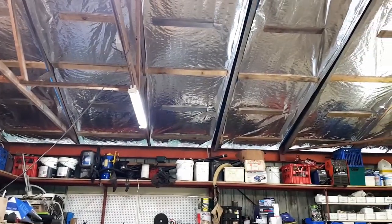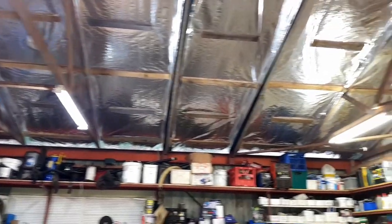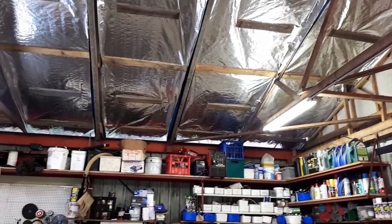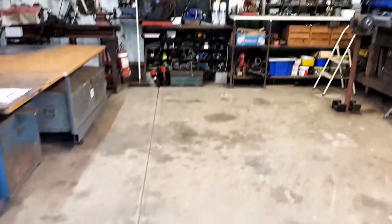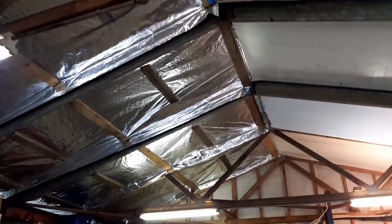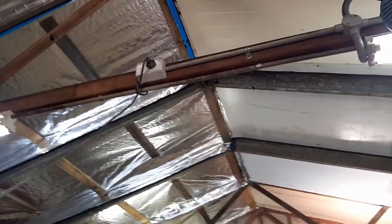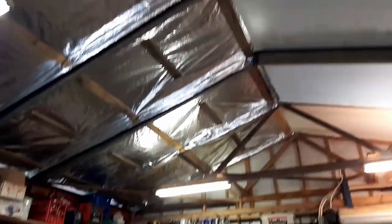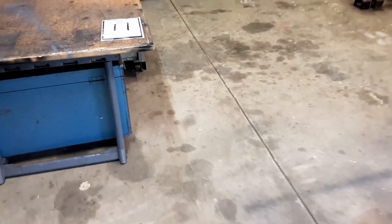We've got a few hundred mil between that truss just there and where the post is going to be, and the same with the other side. We've got a couple hundred mil on each side, so it worked in perfectly for that. And I've already got the unit powered. Previously, when I had a bit of wiring done, I got the electrician to put a 15 amp power point just up there to connect the hoist to on this side. So we're ready for old mate to turn up.